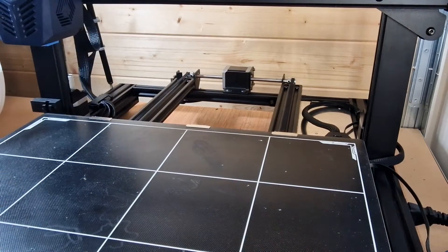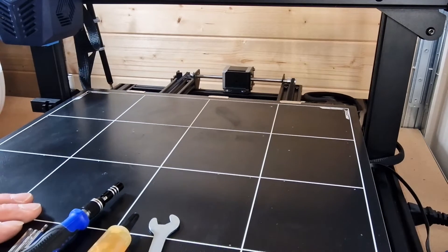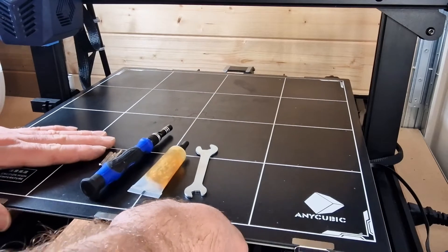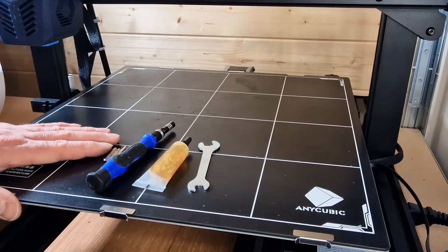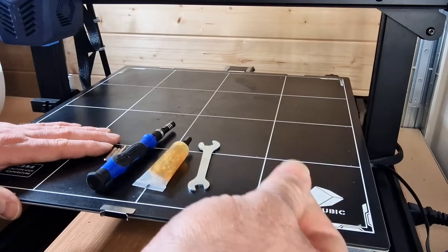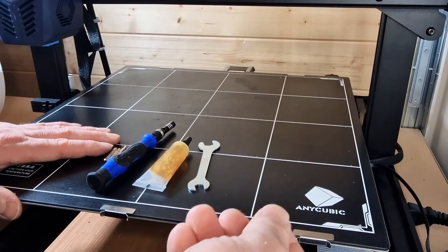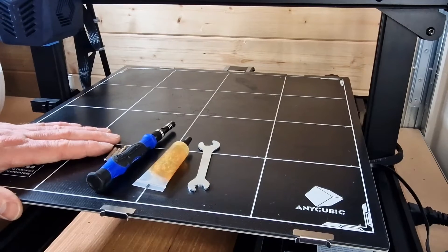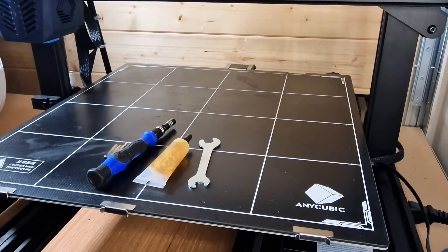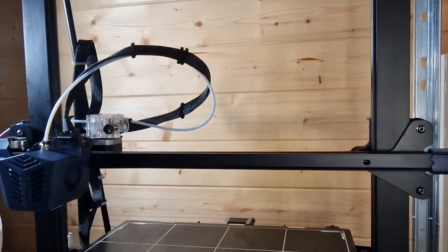Move the bed gently back and check the wheels. Make sure the belt isn't rubbing - you would notice it on the wheels. There would be some rubber fraying, like a dusting of residue if something's rubbing. I always check for residue and dusting of rubber.